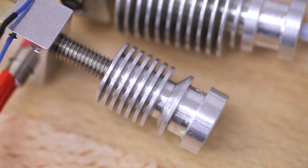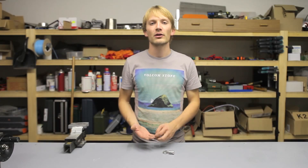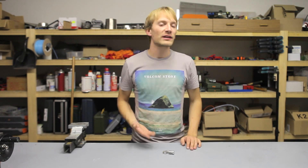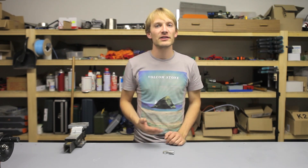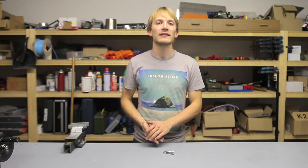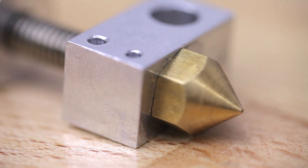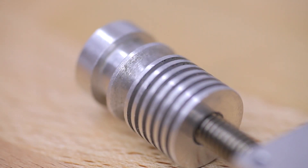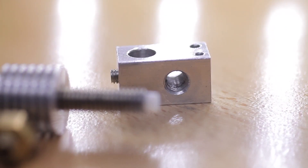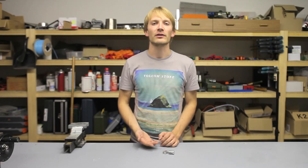On the other hand, there is very little surface area on the Alu Hotend's heatsink, so you will still need to use it with a fan or with one of the aluminum extruders with the heatsink attached. The full kit includes a fan, but no way of mounting it, so you will need to figure out a way to attach it to your carriage yourself without cooling the heater block too much. Overall, the machining on the Alu Hotend is usable — it's not spectacular in any way, but it's absolutely good enough. The one I got had a bit of gunk in the threaded part of the heater block, which made screwing the heatbreak and nozzle in and out a bit more difficult than it needed to be.